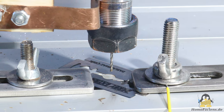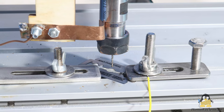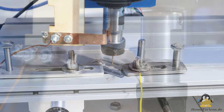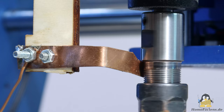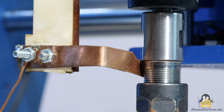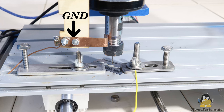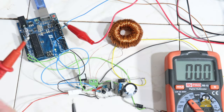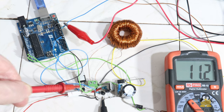In the second attempt I'm using the same, now somewhat blunt 1mm drill bit, but apply a DC voltage of about 30V between the workpiece and the drill bit. This requires the sliding contact which is made of a strip of copper sheet that touches the chuck. Ground of the circuit is connected to this copper strip. The plus 30V line leads to the workpiece holder via a screw and then to the razor blade. Those 30V are generated from an input voltage of not quite 12V by a very quick and dirty soldered step-up converter.